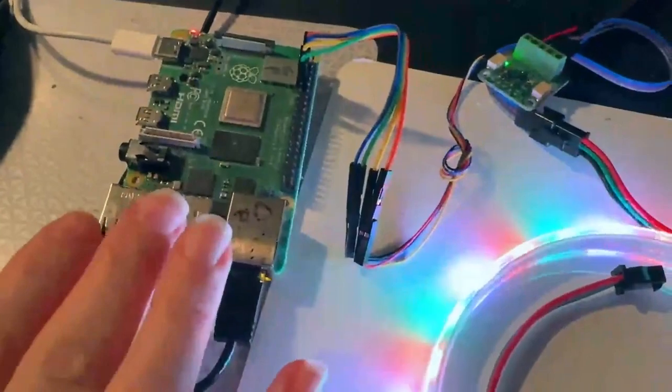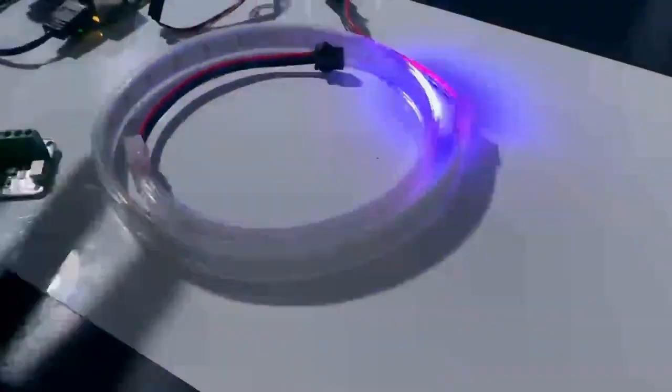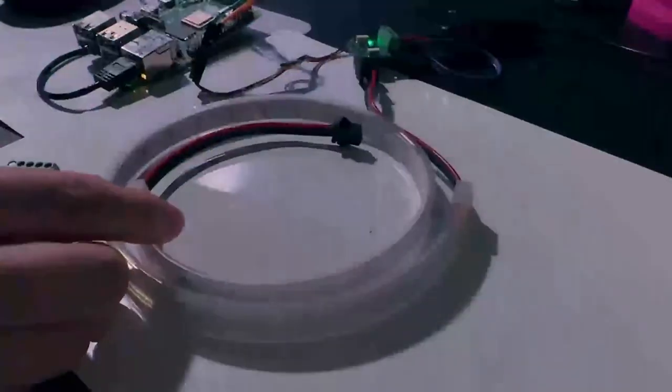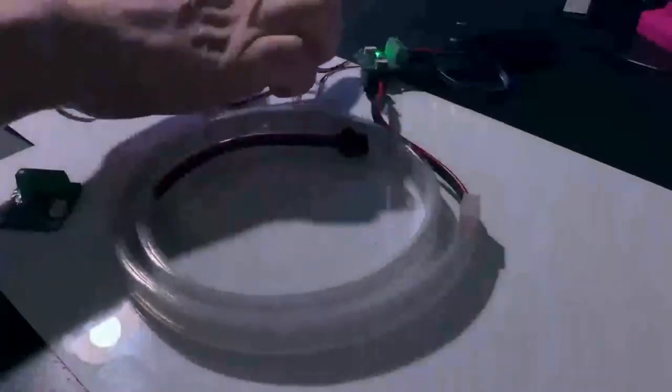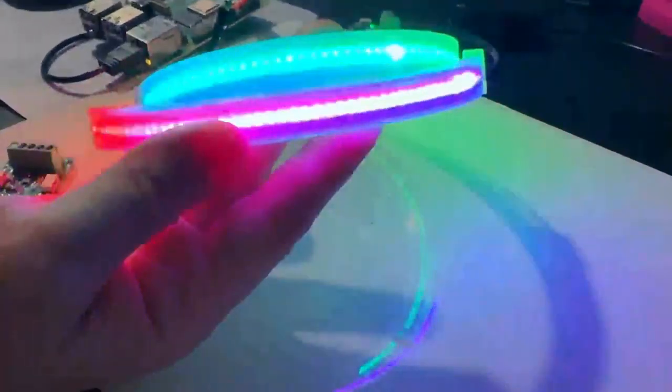And what's interesting is that, yes, this is a Raspberry Pi, and we could run NeoPixels directly from it. But because this is I2C, this will work on any single board computer or device, even if it doesn't have NeoPixel bit-bang timing support. You can just send the commands over I2C, and it's converted to NeoPixels. And that's Top Secret of the Week.